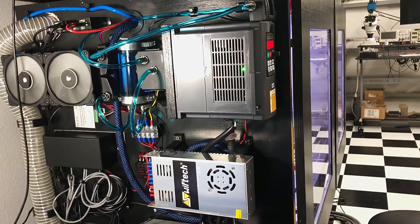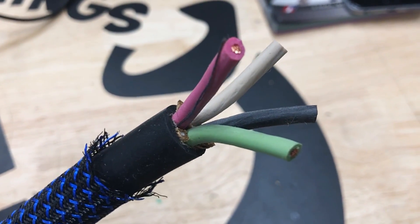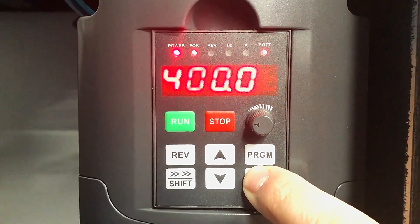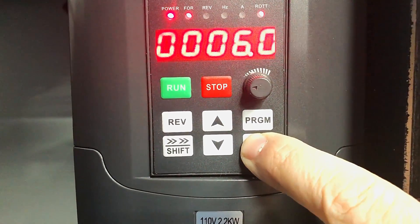Next, wiring the spindle to the VFD — I used a 14-4 double insulated wire which I ran through a nylon braid to finish it off. This would more than handle the 20 amps spread across the 3 phase wires, using the 4th wire as a ground. The wires were soldered into the spindle connector and connected to the VFD. A PWM and ground wire were run from the carbide control board to the VFD to control the spindle speed with M3 commands. I had to change a few minor firmware defaults in Grbl, and then after reading through the VFD user manual, I made a few adjustments to ensure it was properly configured for the voltage and amperage of the spindle. All of those settings are available in the description below.